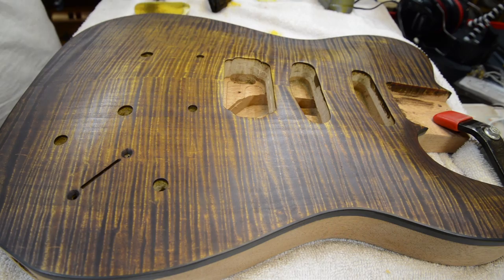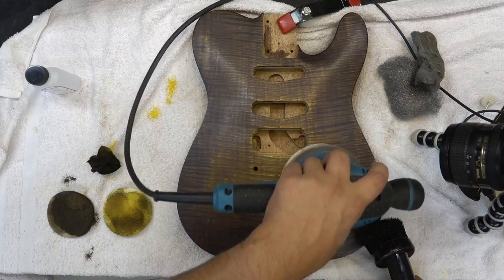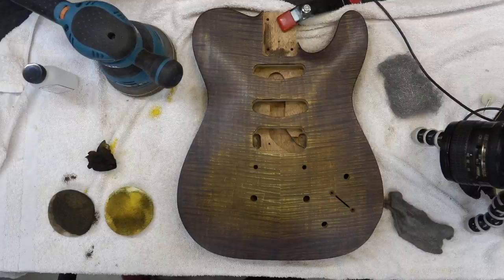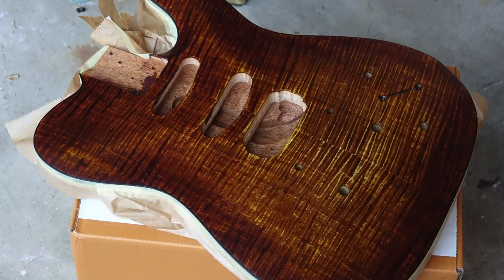So I come back with the same sanding pad and a thousand grit sandpaper — that really clogged up and pulled some of the color out and left little blotches on the wood. So I came back with the fine steel wool, rubbed those out, and then rubbed out that last bit of color. At this point it's ready to hit with a sanding sealer. The two pictures I have here are without a flash, and I haven't seen this before with brown and yellow where I'm really having a hard time focusing on the color — that's what it looks like far away, and if you zoom in without changing the lighting you can see that coloring sort of explode. The camera really had trouble picking up this color. So we're going to apply some true oil and go. Thanks for watching guys — we'll see you in the next vid.